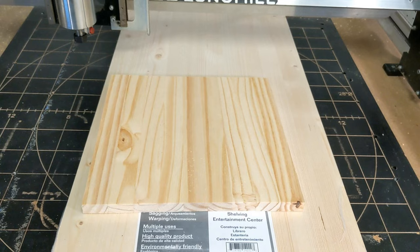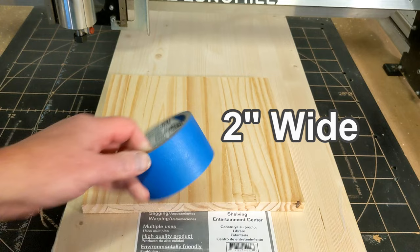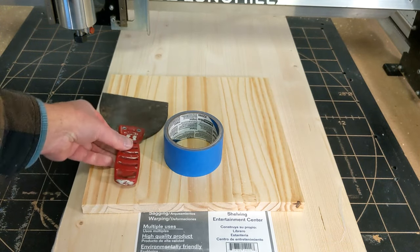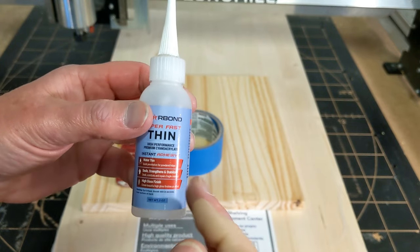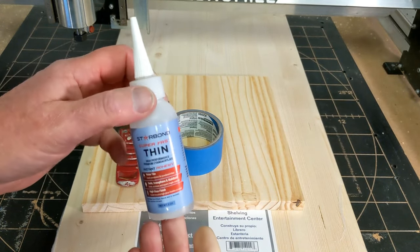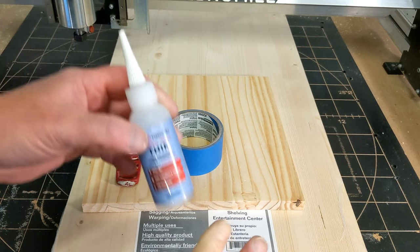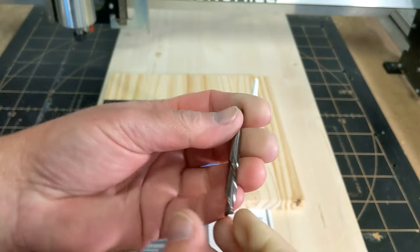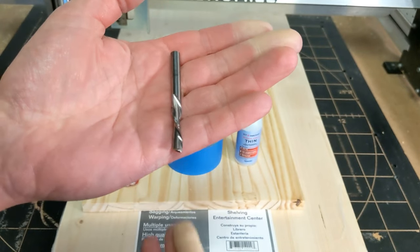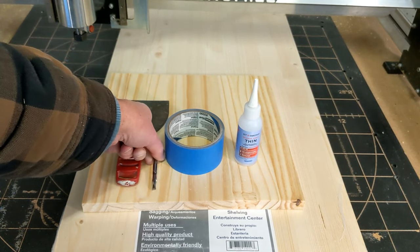Now, since you're making clamps, I have to assume that you don't have clamps right now, so we still have to hold our project down. We're going to use a different technique called the CA glue hold-down technique. Everything I'm going to talk about has links in the description down below. The supplies you need are: painter's tape — two inches wide is my preference — a scraper (plastic or metal, doesn't really matter), and some CA glue. This is Starbond brand thin CA glue — the well-known brand in the CNC and woodworking industry. I've got several videos on how to use this, with links in the description and a 10% discount code. And finally, we need a quarter-inch router bit. This bit will work the entire job — it's the only bit you need. There's a link down below for that as well.